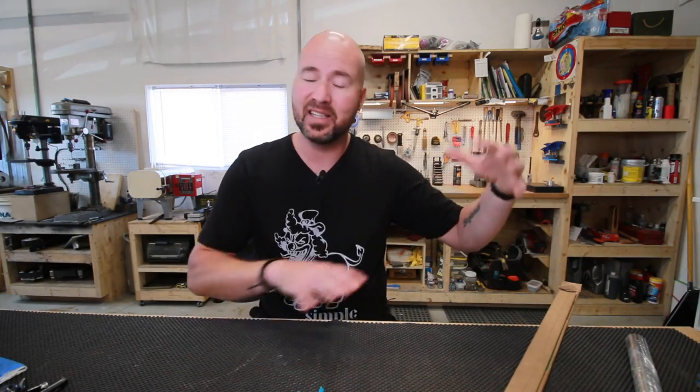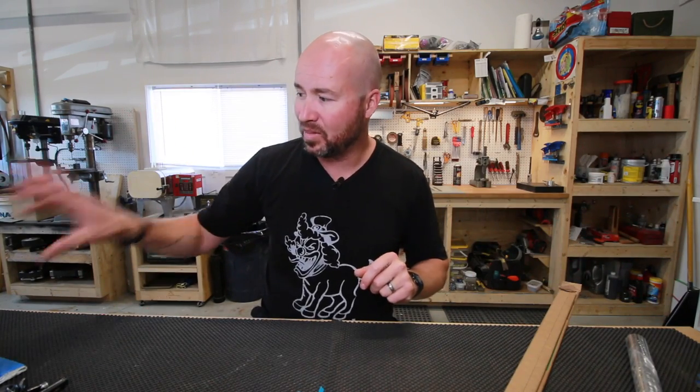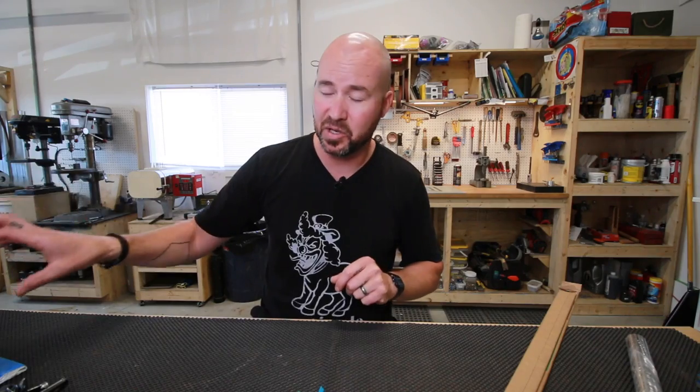Let's do a quick recap. Carbon steels, 1500 degrees, thereabouts, liquid quench, typically oil. Stainless steels, 2000 degrees, typically plate quench or air quench. And a lot of these need the cryo. These ones benefit from the cryo; it's not necessary, but they do benefit. A lot of these do need it, but some of them actually don't.